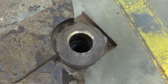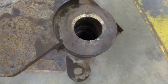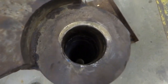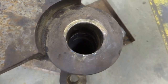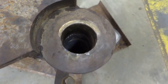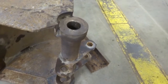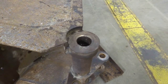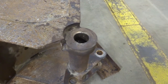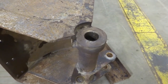It was a good setup, but because my new design — you can see there — I have one-piece pins that pass through the whole length, which requires the removal of the grease dams. On the first one we did, I got my father-in-law to just cut them out with a torch and he was able to do that. But on this one, when we went to do the other half, it turned out that somehow grease had gotten past the grease dam and essentially this whole cavity was just solid grease — I'd guess there'd be four or five tubes of grease in there. There's just no way: he pierced through, hit the grease, and it was just spitting burning oil out of the hole — a real mess. We just can't burn it out, so the only way to really get that grease dam out would be to drill it.